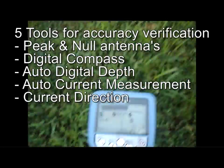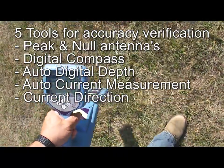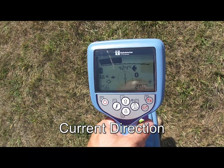Current direction frequency also comes with the 10-watt transmitter. Current direction is a method for identifying your target line in a congested area where multiple cables and pipes could cause a bad location. A current direction arrow represents the flow of the transmitter current, which should always be going away from your transmitter or hookup. If the arrow shows in reverse, you are most likely on the wrong line.